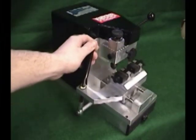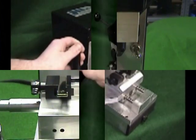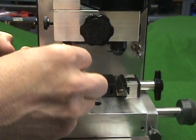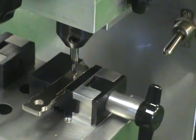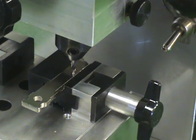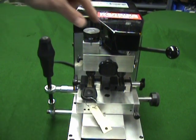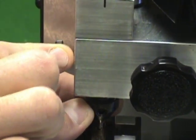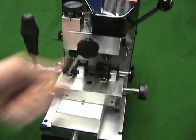The table has a guide lever that controls table movement, moving the table both in and out and side to side. The left collet holds the guide. When changing guides, insert the guide into the collet and push it up all the way until it bottoms out, then tighten the Allen screw with a 1/8th inch Allen wrench. The right collet holds the cutter. At the top left side of the machine is the guide dial, which detents in the set position. The dial should be on set whenever you are aligning the cutter and guide. On the left side of the assembly is the guide lock knob; when engaged, the knob holds the guide in a raised position used for duplicating. In the front of the machine is the cutter head clamp nut, which holds the entire cutter head assembly in the cutting position.